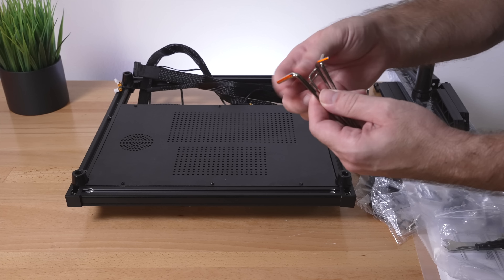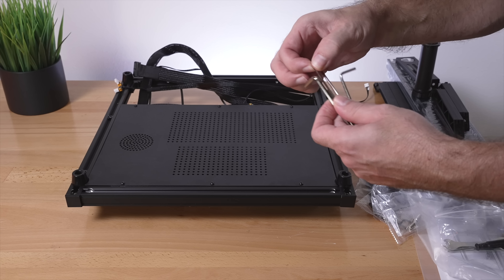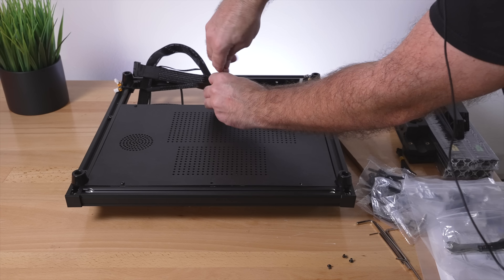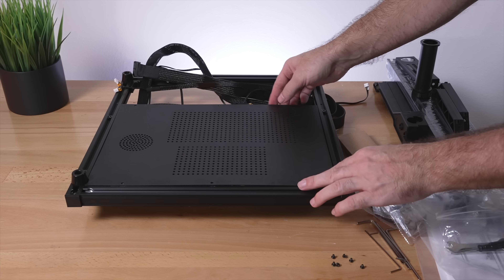For the tools we have a little flat screwdriver, two open-ended wrenches — the small one for the nozzle and the larger one to adjust rollers — and a full set of allen wrenches in all the sizes you'll need to put the printer together. Let's grab the correct size for these little bolts and take them out — there are only six of them — and we'll see what's underneath.